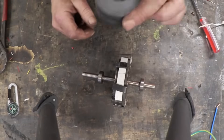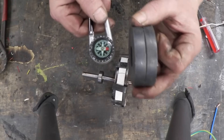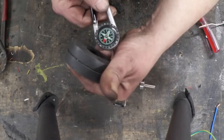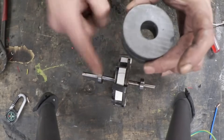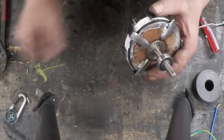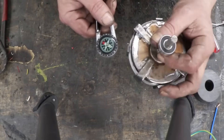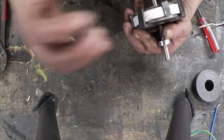Now we can see what we've done with the help of two other speaker magnets and a compass. If I hold the speaker magnet like that, we can see it's pointing to south — flip it round, no hesitation, points to north. If I hold it flat and follow it around, not a lot happens. But with our modified rotor, the north follows the north and the south follows the south — that's the south face, that's the north face. What we've done with these bends of steel is direct or bend that magnetic field, so now we get a straight north, then a straight south, then a straight north and south and so on. We've bent the magnetic fields to these poles, so now we have north, south, north, south pointing at the edge.